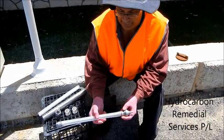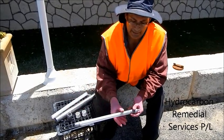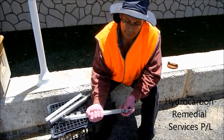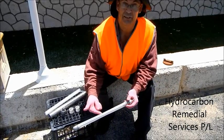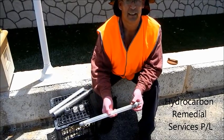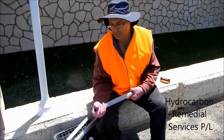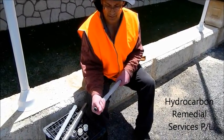So it'll be an on-off cycle. As it shuts off, the water relaxes, comes back into this tube, and waits for the next cycle time at which air is applied. With this type of sampling, air does not come in contact with the water that's being sampled. That's why this type of sampling is required on sites with anything to do with volatiles or semi-volatile compounds.